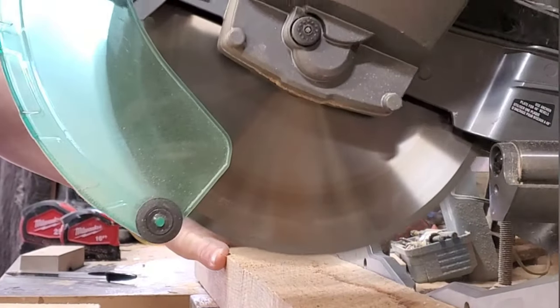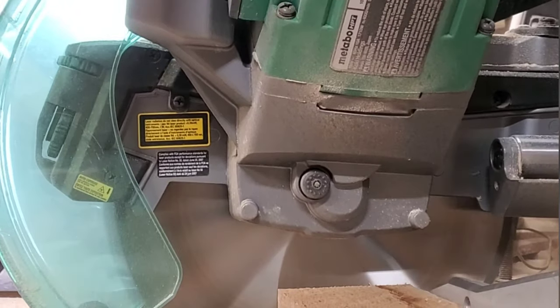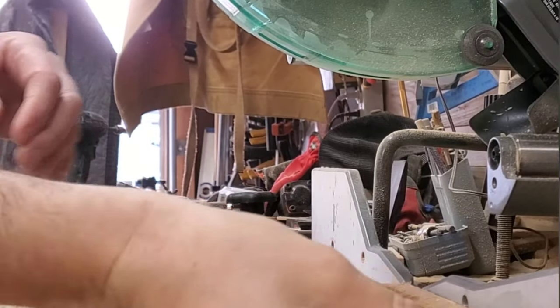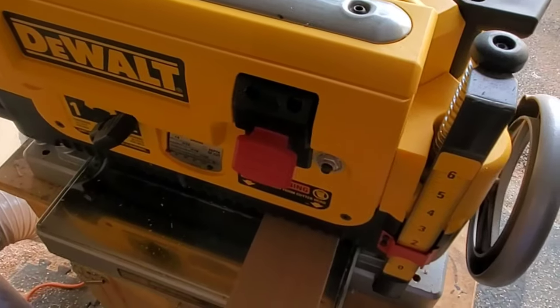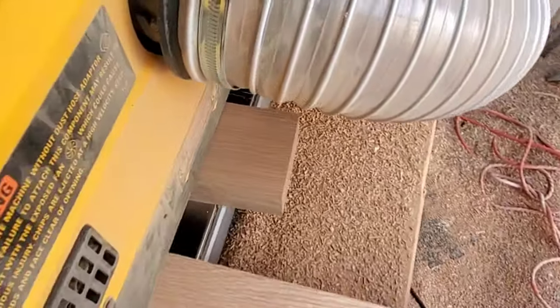Okay, so now we're on to the aprons and stretchers. We're going to be cutting these. I think they're going to be 20 and 27, 20 inches for the sides and 27 for the fronts and backs. There's going to be no bottom aprons and stretchers. It's just going to be top, almost like a basic dining room table. They didn't want any bottom shelves or anything.